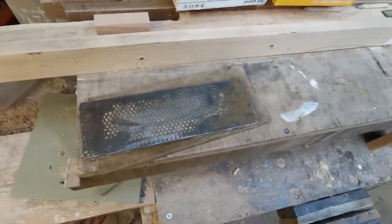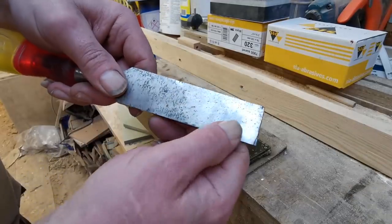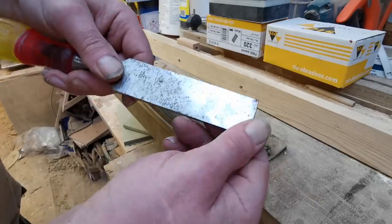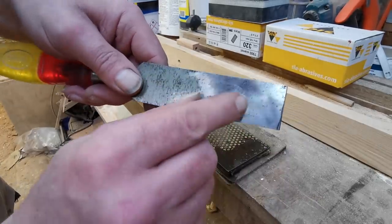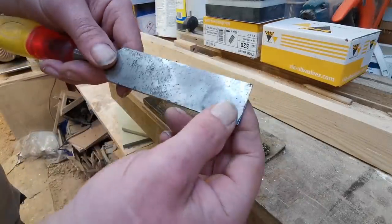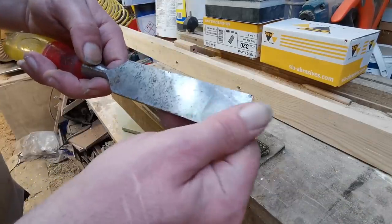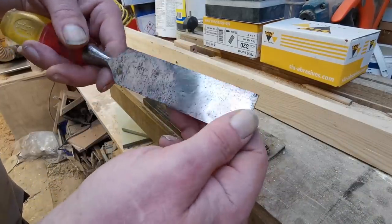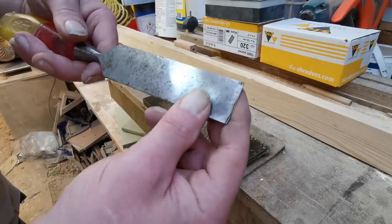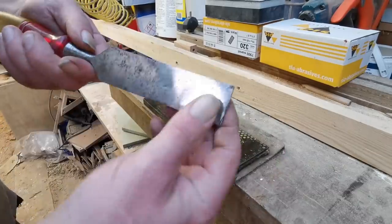Right, sharpening. I'm going to wash this a bit in the water outside. And like I was saying, you want the back to be as flat as possible, especially on that front edge there. I found it quite hard to get this one flat originally. See, there's still a bit of a shallow there, and I haven't bothered sharpening up here. One of the worst things you can do is use it as a scraper. That makes it really hard sometimes to get a sharp edge on that edge, because you're rounding over that edge, basically. I do it quite often, but I don't have a lot of choice, and when I do, I try not to get carried away.